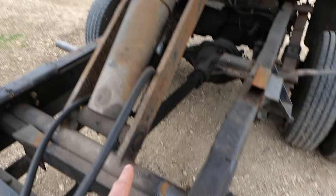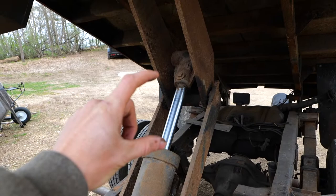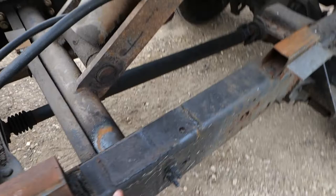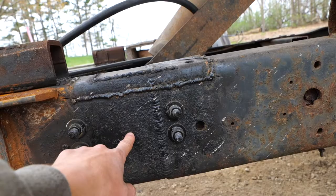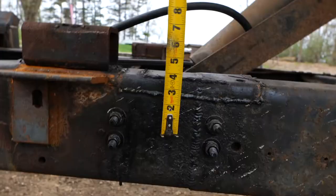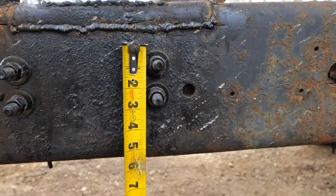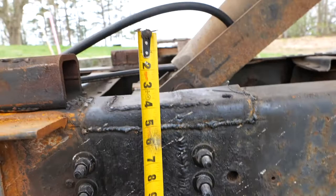But this piston is starting out extended already 2 inches, okay? That 2 inches right there translates to like 6 inches right there. As you can see, this hinge, if you actually get down here, it's starting there, the hinge is there when it should be here, okay? That's a 6-inch difference, to the middle of this block, approximately. I'm guessing that plate is probably around 4 inches big, okay? So if that plate is on top of here, it might need to be ground, might need to be recessed, might need a bracket welded on the outside of this.